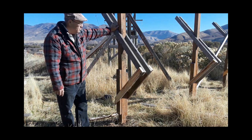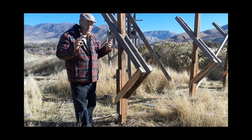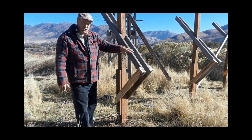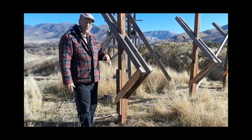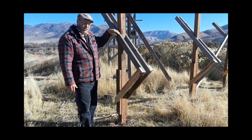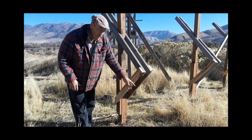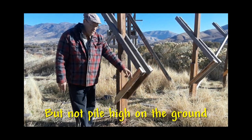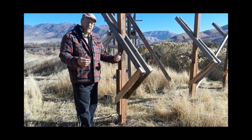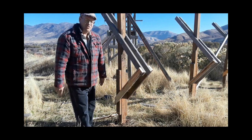The other reason they're set at that angle is because you need a slope — we do get snow here, sometimes a lot, sometimes not. With enough of a slope, after a big snowstorm the first time you get any sun at all, the snow will generally slide off the panels. They're also elevated above the ground because as the snow slides off it piles up at the bottom, and if it piles up high enough you've got problems — the snow has nowhere to slide to.